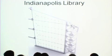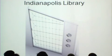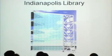We've even got a horizontal cable wall. This one, again, the glass is stacked. That sits on that, they all sit on each other. And the only thing that restrains the wall are these horizontal cables. Right? And we've even got a little lever here so that the weight can be reduced due to the lever principle. But it means it moves a lot, so that what the client wanted was that you'd actually see them moving up and down. So they put the sort of city medallions on them, and when the wind blows, because it's magnified, you really do see them move around.